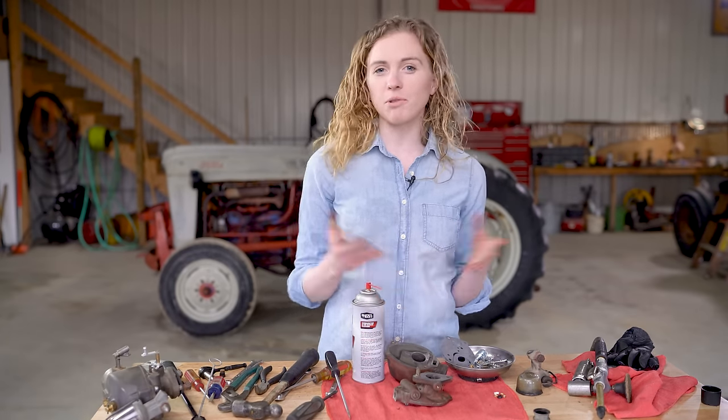Let me show you how to put a new packing in. This rubber packing goes up here at the throttle, and there's a felt packing in your kit that goes for the choke shaft. So I'm gonna put this in this direction. It is directional. So I'm just gonna set that in there all the way down. And then there's two pieces like this that come in your kit. The bigger one goes up here at the throttle. And then I just rest it on there.